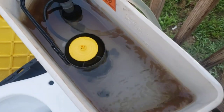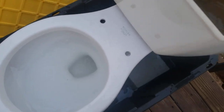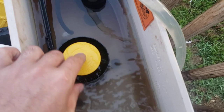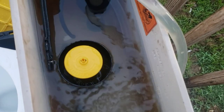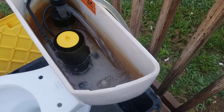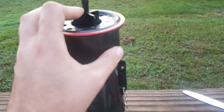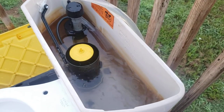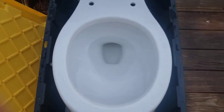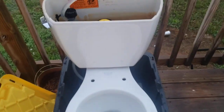These canisters do stay open a bit longer — putting one of these in the three-inch Wellworth/Highline will give you a good bit better flush. Now it's still going to fall shut a good bit faster in a typical Class Five, there's no fixing that, that's just the design of the toilet, but it will stay open noticeably longer than the red canister in the same situation. So if you need a better, longer flush in a Class Five, try one of these aqua pistons that's meant for the Cimarron — it'll help you out. It provides a decently long enough flush for a Wellworth Ingenium.